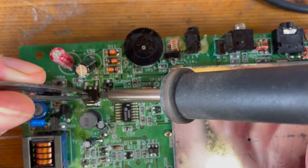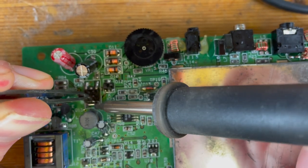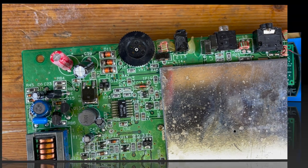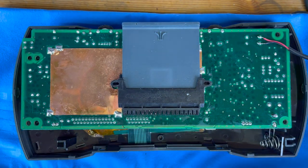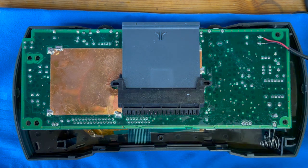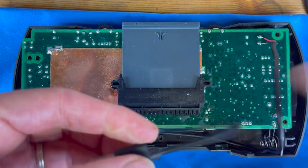Lots of patience required on the MOSFET because there's a big ground plane underneath that needs to be fully desoldered and soldered back. It's also worth noting that I discovered another trick to test the Lynx itself — by bypassing the power circuit. Maybe it's a bit late now, but if you've got a USB-A socket and solder it up to this point here, you can just plug this in and get 5 volts straight into the motherboard.